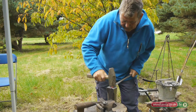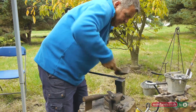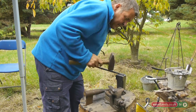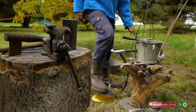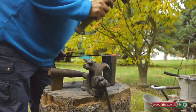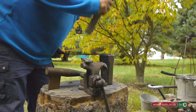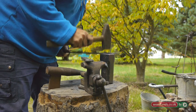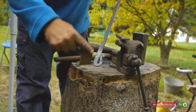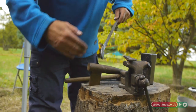It's quite a gentle process. While I've got some heat in it I'm just going to knock the end over. Effectively that's a finished form. I'll clean this end up with a file later, but that's the sort of shape I want. I'll let that cool naturally after I've straightened it out a little bit more, then we'll clean that surface up.